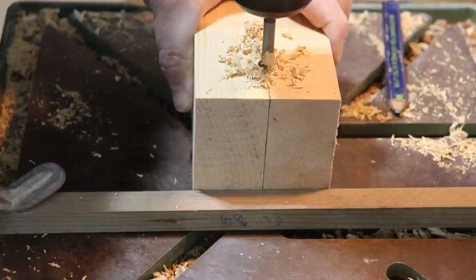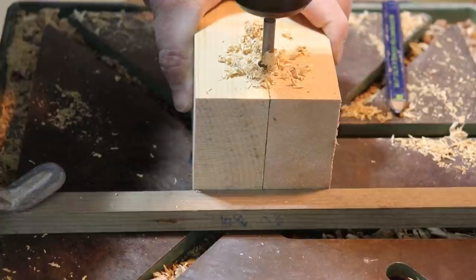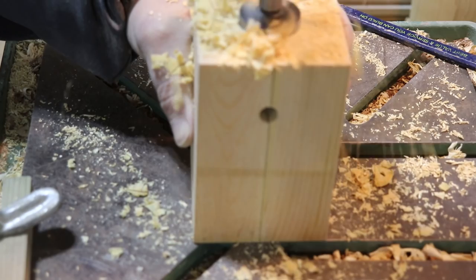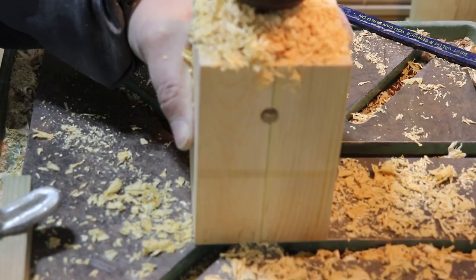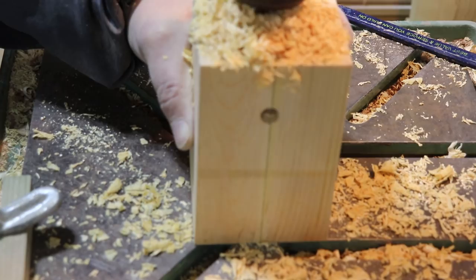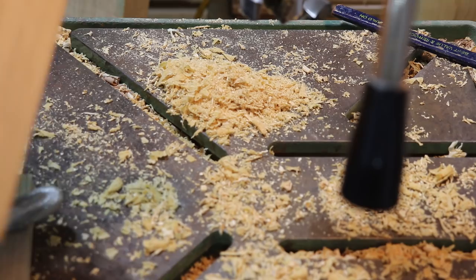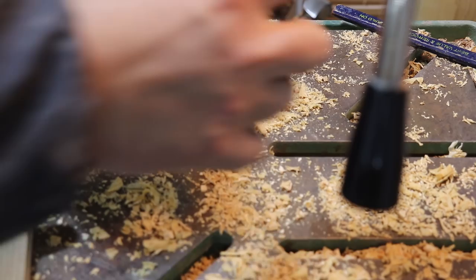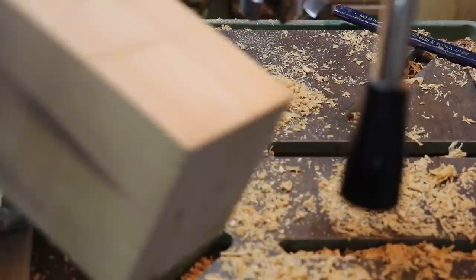This week we're going to make both an ornamental and a full-size functioning birdhouse on the lathe. We're starting off at the drill press. This is just two pieces of scrap pine glued together — about three and a half inches squared by five inches high roughly. I'm drilling a little hole in the side, which would be the entrance hole for the bird, and now I'm hollowing the end grain out, which would be the cavity where the bird would live. This is the ornamental birdhouse. You can do this with a drill and a Forstner bit if you don't have a drill press, but it is much easier in a drill press. The most important part is that you drill the side hole first and then do the end grain second. You can make these any size out of any kind of wood — laminated hardwood, very decorative — and expand on this idea as much as you want. This is just a nice basic one from scrap wood that someone would paint.